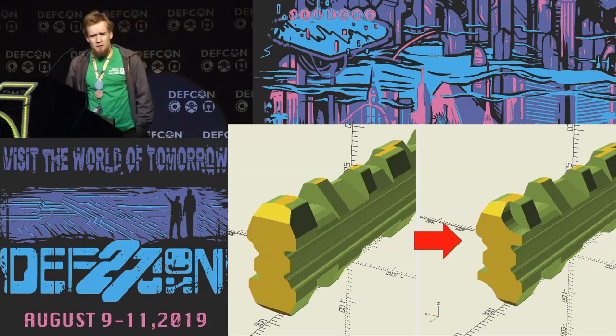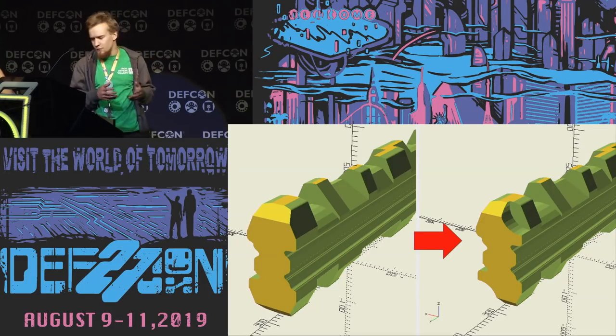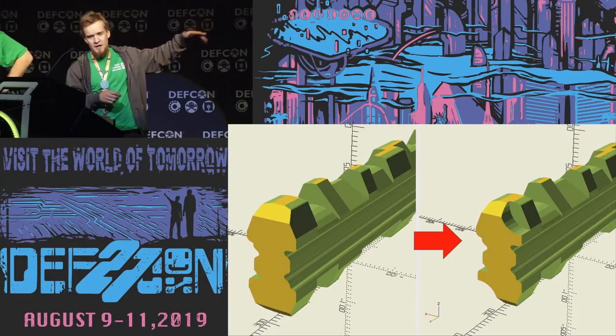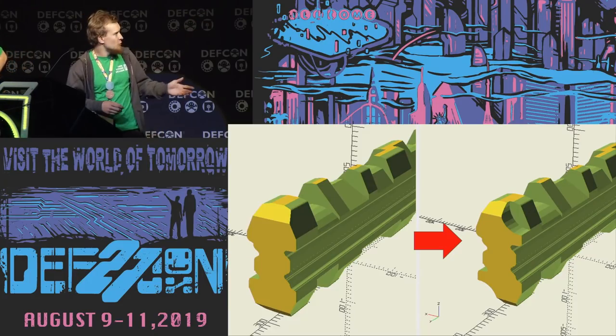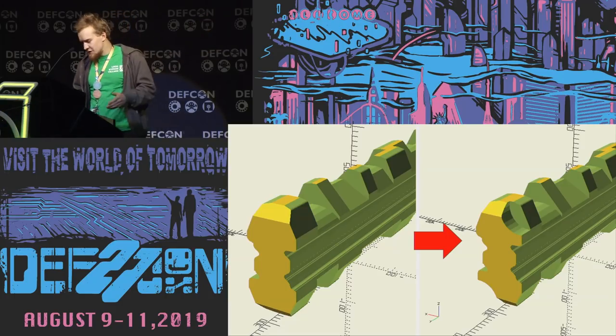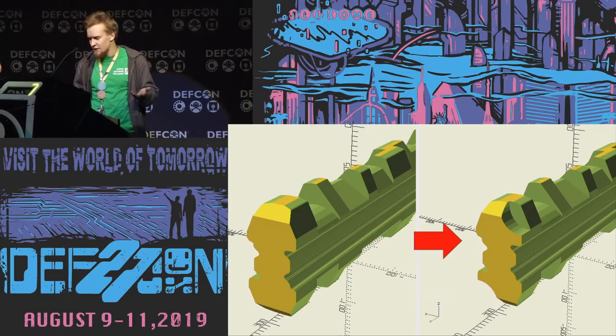So one thing we haven't covered yet, tip warding is similar to the warding on the blank of a regular key. Abloy also has warding on the tip of their key where when you insert it, it can go almost all the way in, but if that warding isn't correct, it won't be able to go fully in, and the bidding won't line up with the disks, and the interactive element won't line up, so it won't work. So, you know, this one's pretty simple, but some of them can be complex looking,